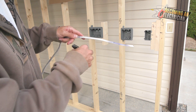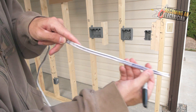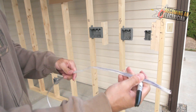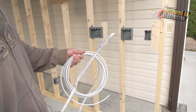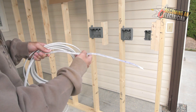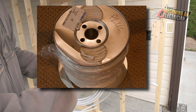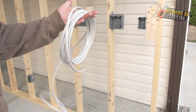When it comes to labeling for power, a lot of people just draw a line. If it's a plug, you write 'plug'; for a baseboard heater, you'd write 'BBH.' When pulling wire off a spool, you label one end of the wire and also label the outside of the spool itself. That way when you go to cut the wire, you can label the other end right away without any guesswork.